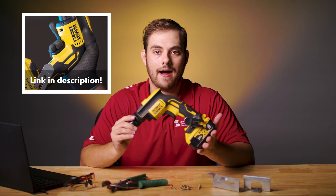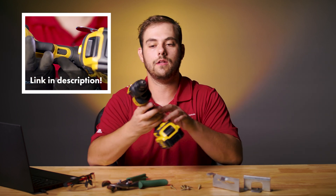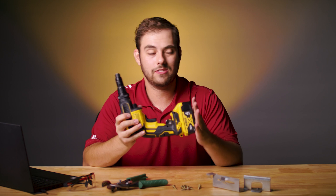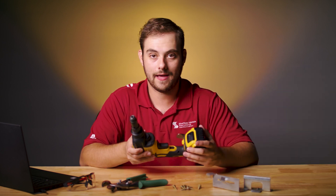I did a review about this gun, which is DeWalt's screw gun that has Versa Clutch — torque controlled, specifically designed for metal roofing applications. So use something like this, or a drill that you can control the torque and get into that 2,800 RPM range.